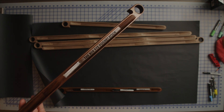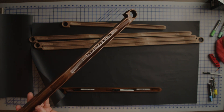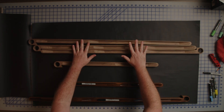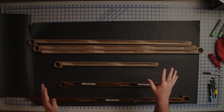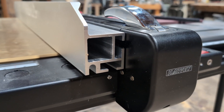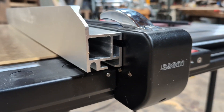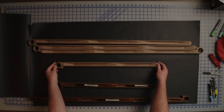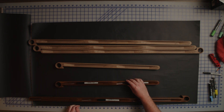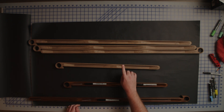That's about as big as I could make the text without the bit running into the side walls. I really like that detail, and if you're going to be selling this it's one of the details that will help sell it. These are all directly off the CNC machine with a small round over and simple spray can finishing. But I think that is going to scratch up because the inside of the aluminum profile is a complete 90 — they have not softened that edge at all. As you push this in and out it's going to interact with the sharp aluminum edge and scratch. I'd probably use some type of hard oil finish, because that will weather nicer and won't abruptly look scratched up.